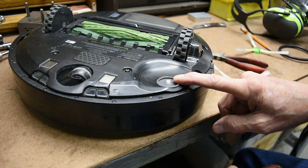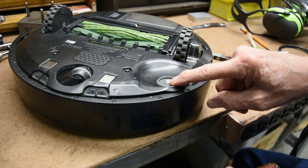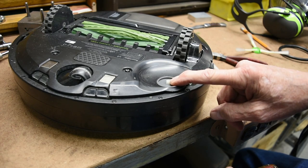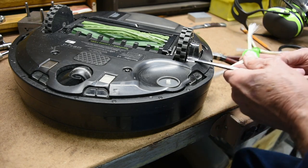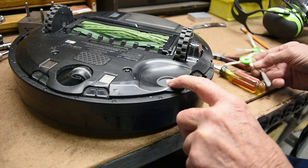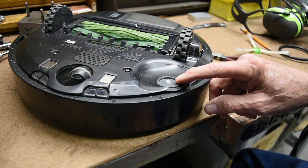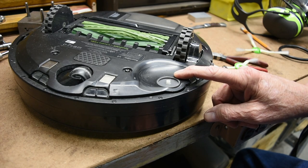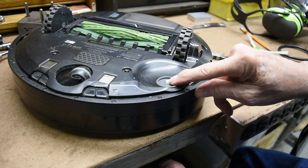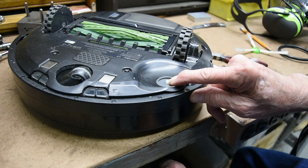However, in spite of your best efforts to not over-tighten the screw into this little nylon shaft, you'll find that after about the third brush, that screw will no longer take purchase in those threads. I've tried a number of things — superglue, epoxy, even Loctite — and none of those things really work. I tried retapping those threads with a slightly larger screw, but that really didn't help.